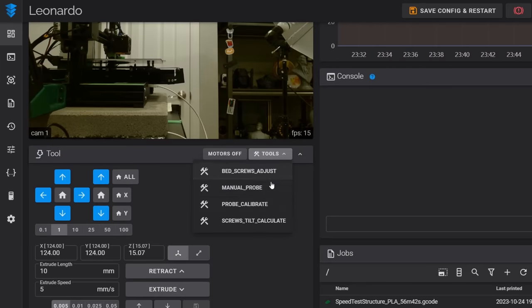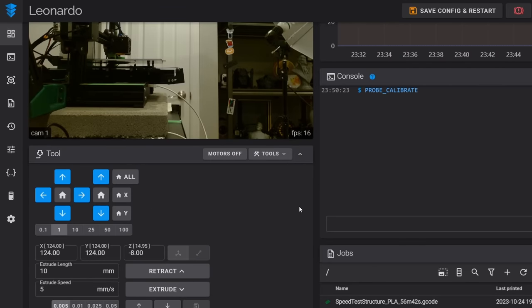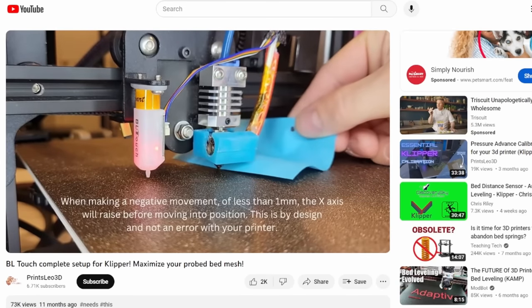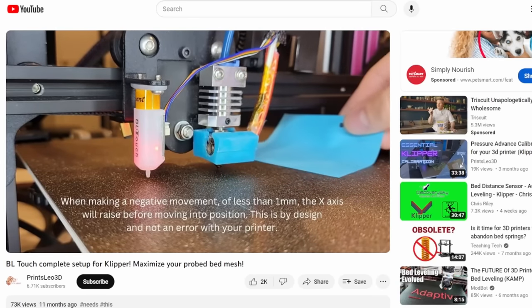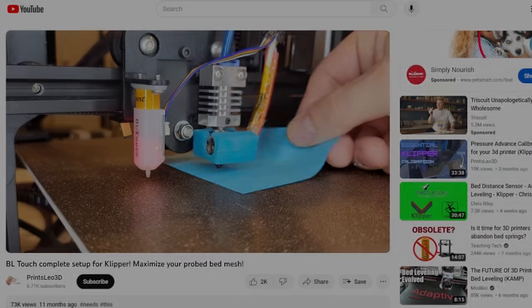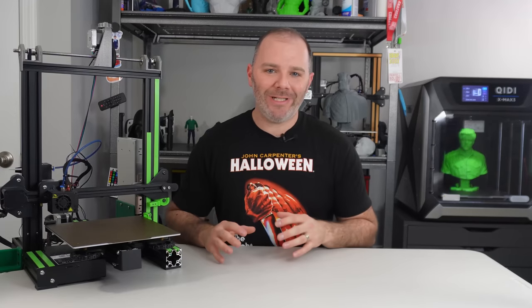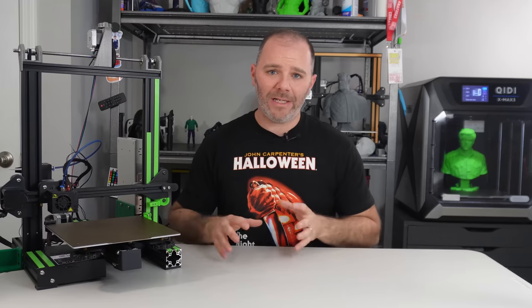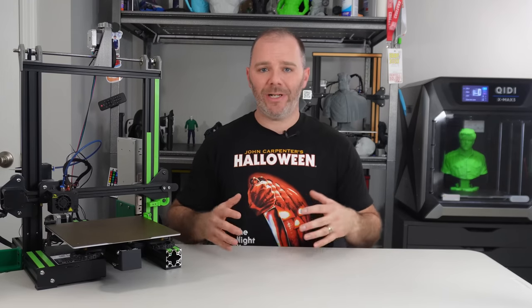After you are done with this calibration, you aren't quite finished. You still have to make sure to readjust your Z offset, and that is done through the routine probe calibrate. If you are unfamiliar with this, you can find exactly how this and other BLTouch operations work in my BLTouch Klipper video, which I've mentioned a few times in this video already, and there will be a link in the description. For me, this Klipper routine has worked wonders. I've used it on all my printers that require bed leveling, and every time, it's always been a success.